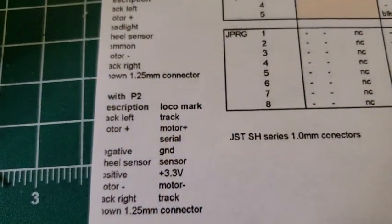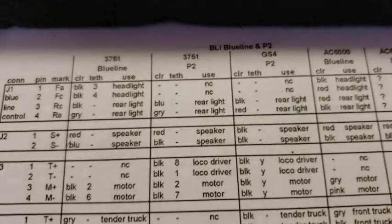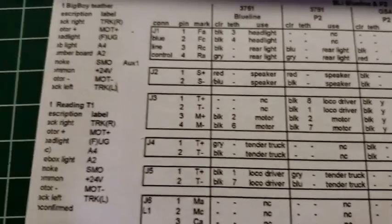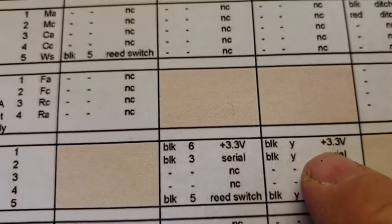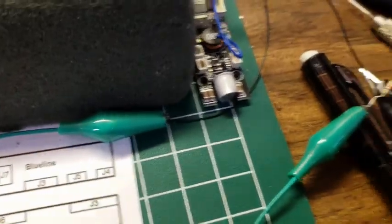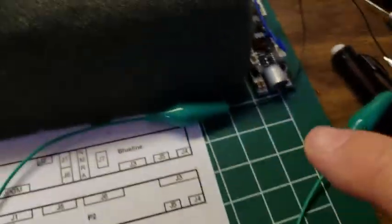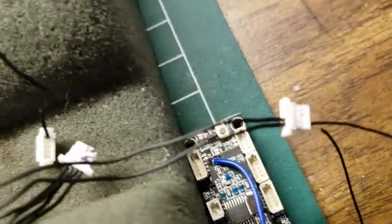So it looked like we had, based upon this, that the positive actually up in right here, yeah, right here, the positive would be the outside lead. And as we've got it set up here, positive, green, green, green, goes to the outside lead. Yes. Okay. So based on that, then this should come on. So when we turn the voltage up, and sure enough, there it comes on.